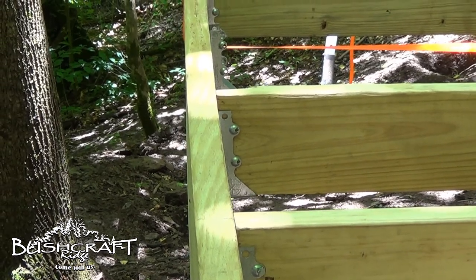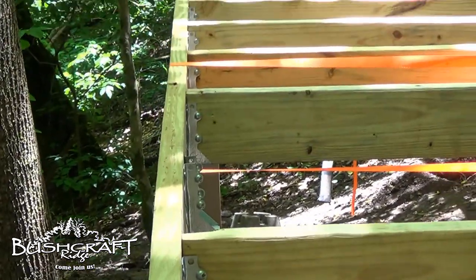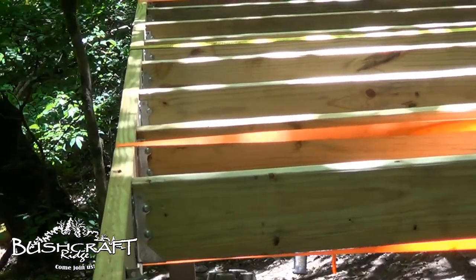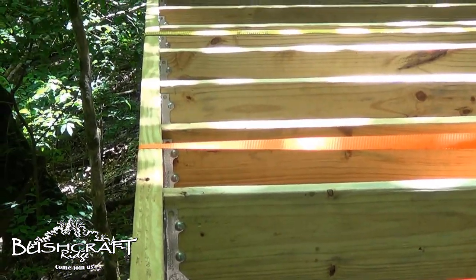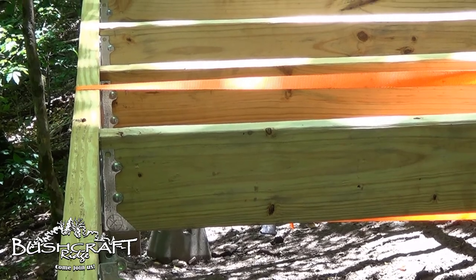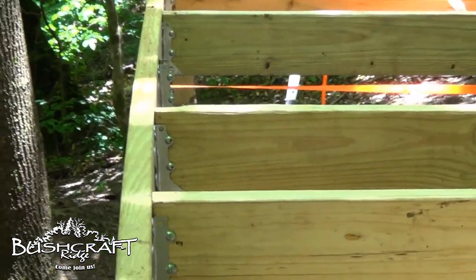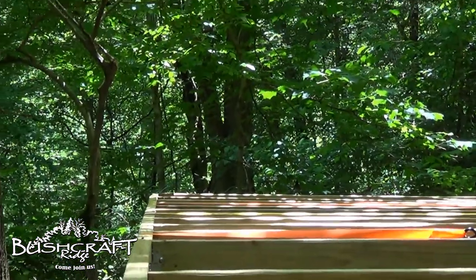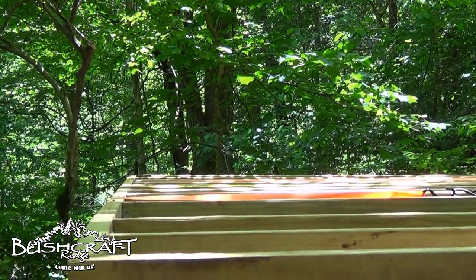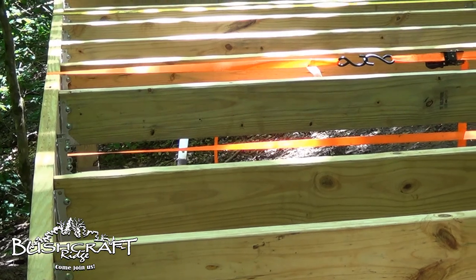It's a turkey — you hear that? It might be too far away for the mic to pick it up. So you see how flush we are and how level or straight it is from this joist right here where the orange band is, between those two to the yellow band to the orange band on the far side. And then down here — see that bow? Yeah, there it is. See that bow? We got the same thing on the far end, so two more strap setups and this thing will be golden.